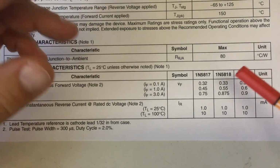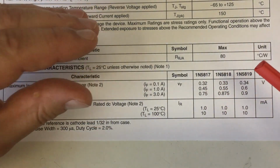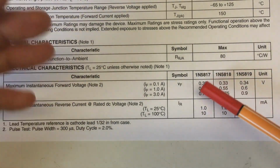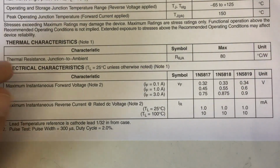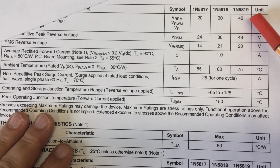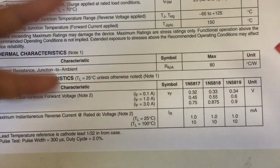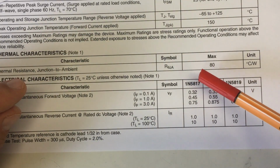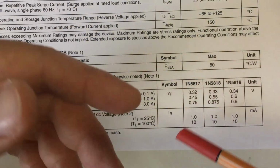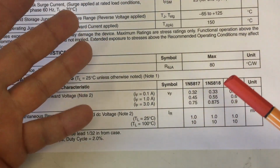There's also probably less capacity in the diode. And yeah, it's faster. It's still a wee bit faster than the 1N5819, which is designed for 40 volts instead of 20 volts. And so I guess as soon as the 1N5817 arrive and I can put them in, things will improve even more.